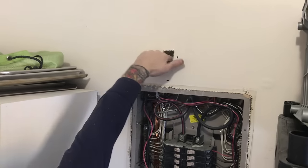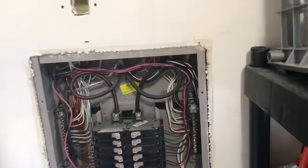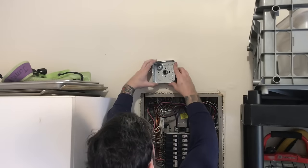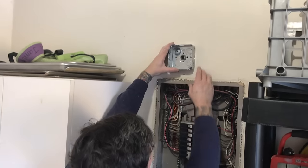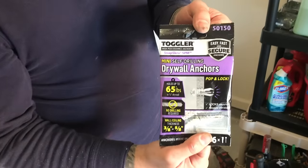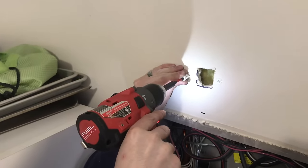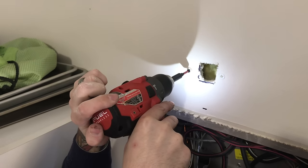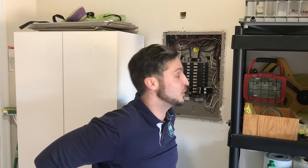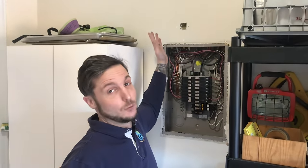We've got a square hole. We can see we've got our insulation, we've got a good bit of clearance, we're not touching any wires. We haven't damaged any wires and we're good to keep moving forward. Now we check and it fits, and we see that the holes that we marked before are still correct. Drywall anchors to make sure that the box gets held in place. If you over-tighten those, you'll tear the sheetrock. So you only get one chance — make sure you do not over-tighten because then it's broken and you've got to start somewhere else.